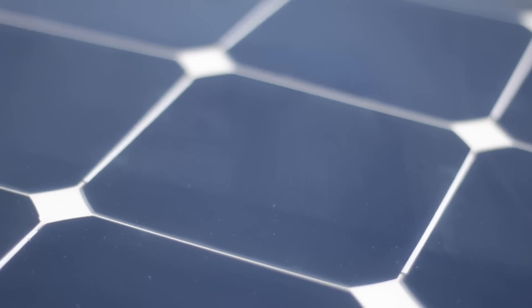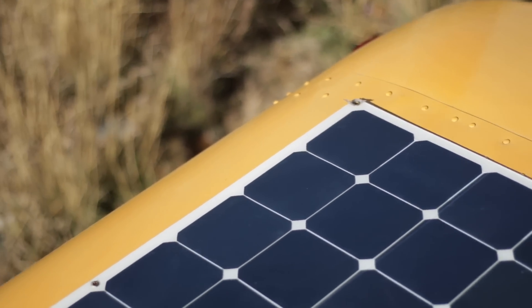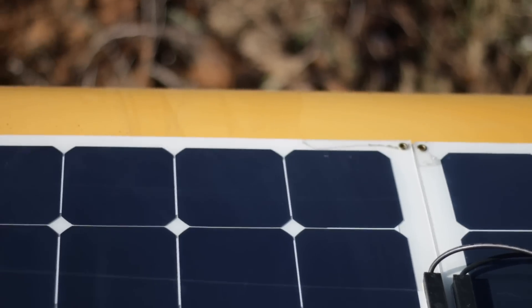With that math done, we only got four solar panels, but we need 450 watts and we never really see 400 watts — you have losses in cables, the sun's not always out, there's atmospheric interference. We really want to get at least two more panels, reaching 600 potential watts, so we can juice the batteries even over a couple of cloudy days. Right now there are times where we can't charge both laptops, so it'd be nice to charge everything when needed.